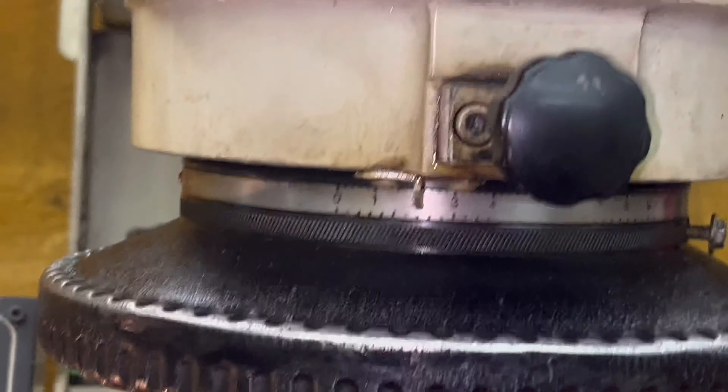Pressure is up at 30 percent, about 3,000 pounds. You can see the rays right here are pretty good ones. Right now we're rough cutting using diamond to get it within about two and a half to three thousandths, and then I'll put the finish stones in and finish it — that's the plan. All right, that's our first initial cut.